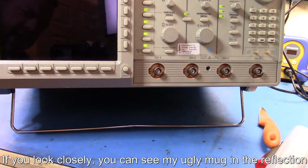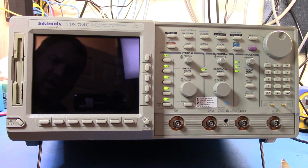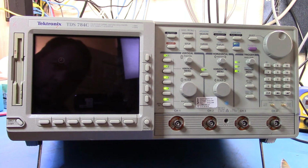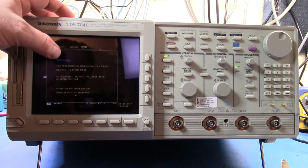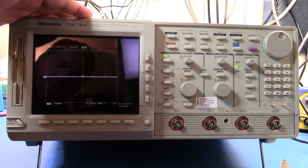dip switches there. So now I'm going to turn this unit on, and you'll see it boot. I accidentally hit the on switch while I turned it around, but we'll see it boot, and you'll see it run through self-test with no errors. And you can see the Agilent little cal sticker there. And here we are. We have options 1.3, 1F, HD, 2M, and 2F on this unit, which are floppy, hard drive, 2 meg, the extended memory. The other is the serial, Centronics, and GPIB ports, and then there's one other, which I forget right now.